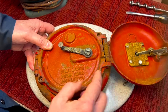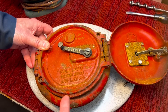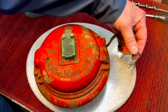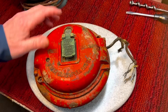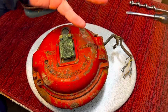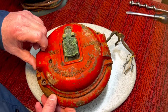It would give you access to this lever. It says 'pull lever down once and let go.' You would pull the lever down — now you hear that winding that's going on. That would send a code through these wires to the fire alarm telling what box this was. You can see here this says 42. That would send 42 to the fire department, and they would know 42 is on 127th Street and 8th Avenue, and then dispatch the fire department vehicles there.